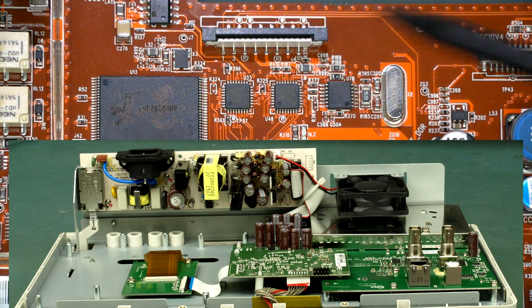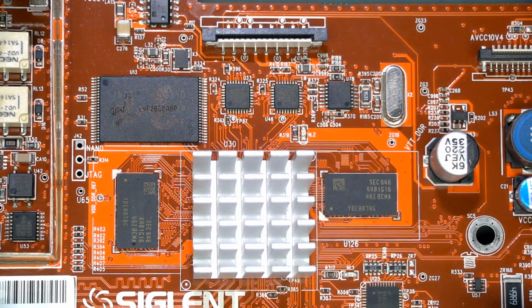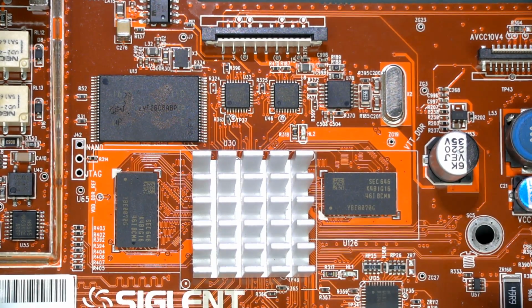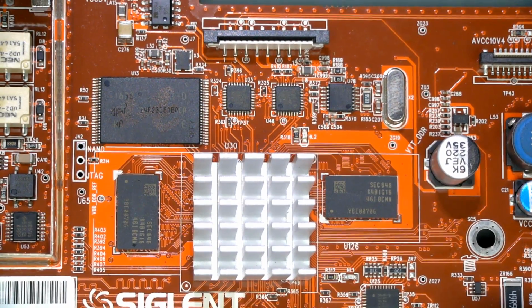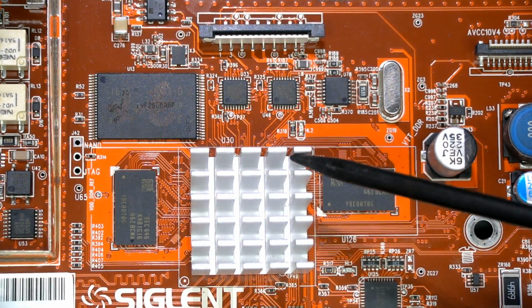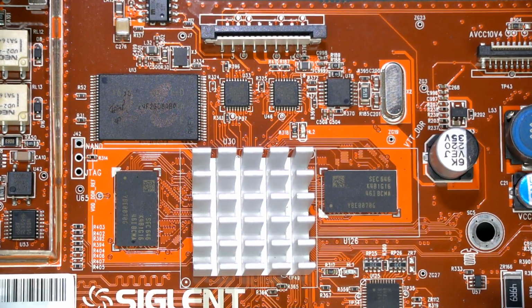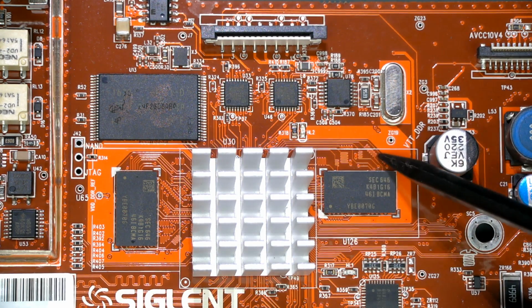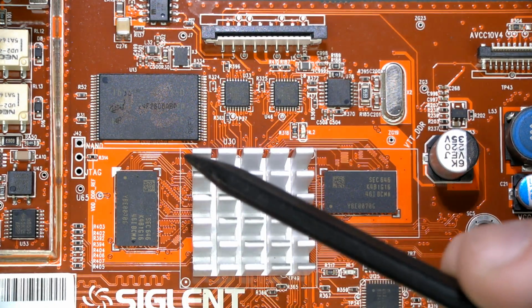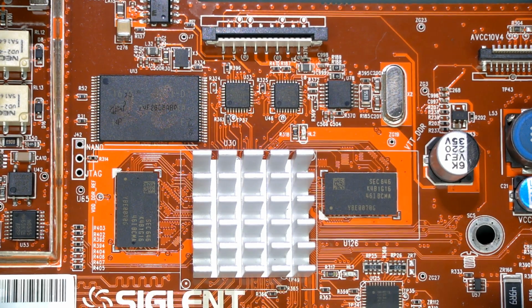And of course, the beautiful thing about the Zynq processor is that it contains not only a Xilinx FPGA in there, a reasonably capable one, but also an ARM, I think it's a dual core ARM processor. So, tightly knit coupling between the FPGA and the internal ARM processor, and hooked up to DDR3 memory, I believe. I haven't actually looked up those numbers, but you can if you're playing along at home. They should be DDR3. You can see all the classic length matching there. They've got the little wiggle, wiggle, wiggle to make them all identical length, because you've got to length match those puppies. Otherwise, you get timing problems at such speed.